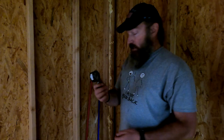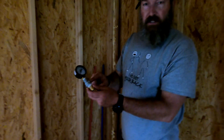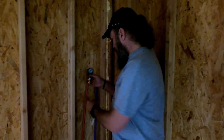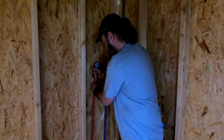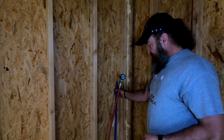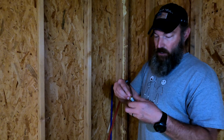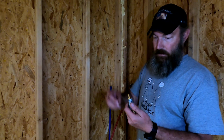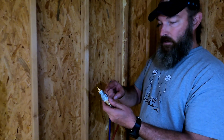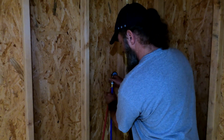Like I said, pressure gauge, and we got the pressure gauge 1/4 inch to 1/2 inch, and then we got it to the 1/2 inch shark bite. So we're going to go ahead and put that on this side. And then, like I said, this is just like you use to inflate your tire on your car, right? Same thing, 1/4 to 1/2 to the shark bite. We're going to put that in here.